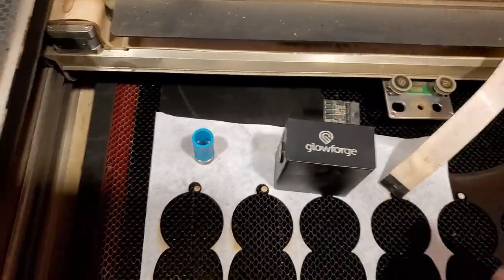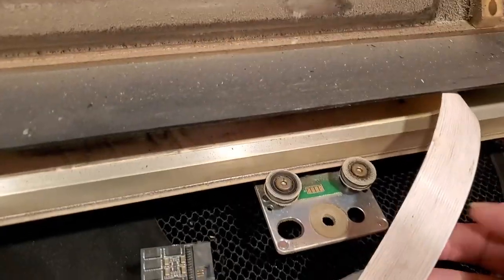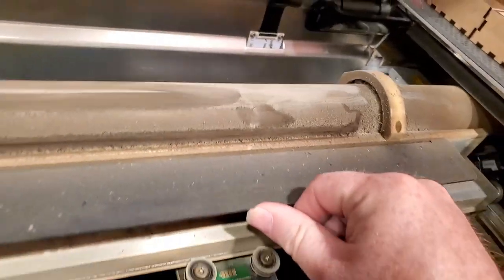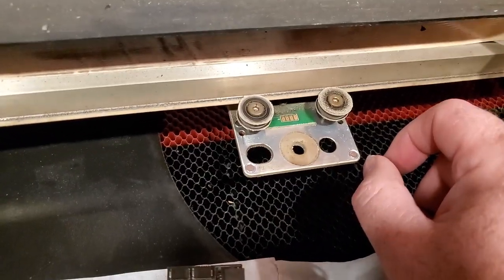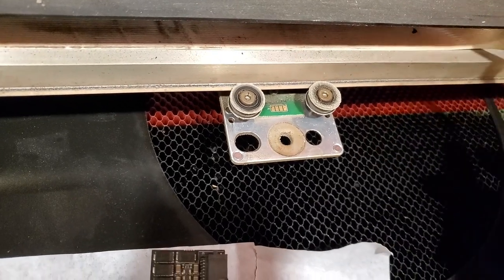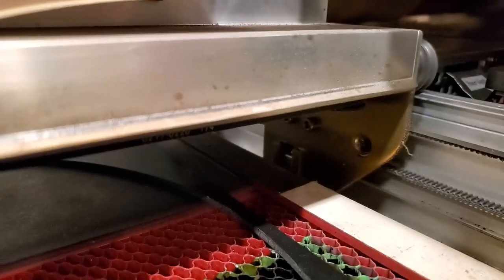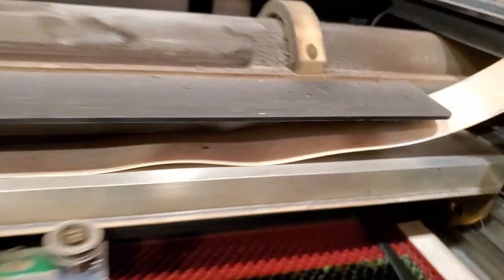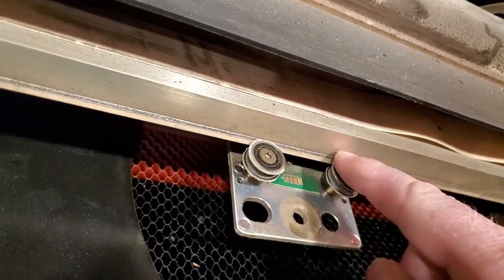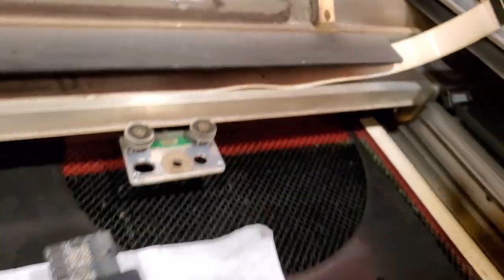I'm going to go through and clean all of these lenses, and then we're going to use an allen wrench to take the carriage plate off so we can clean the air assist back here really well. We're going to take the metal shroud off and clean it properly. I've seen videos saying just use CRC cleaner and spray it on — five minutes later it's all gummy, so I totally do not recommend that. Also, a lot of people say just grab the belt and pry it off the wheel. If you want a broken wheel, go ahead — Glowforge wheels are known for being pretty prone to breakage, so why risk it?